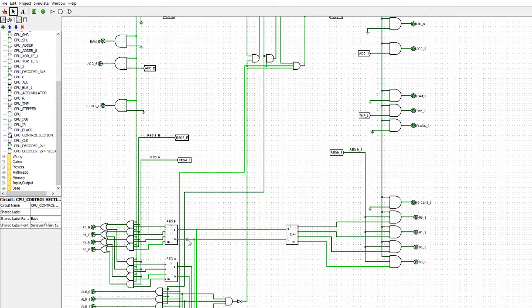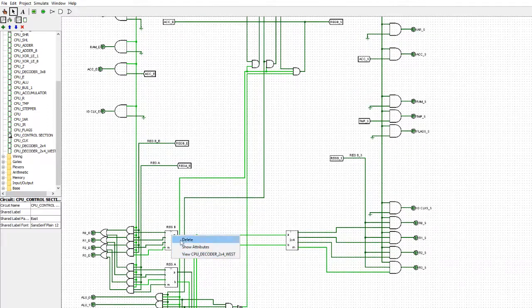Now if we go to the left, that's going to a decoder. So it's just a 2 to 4 decoder. So it takes the value 00, 01, 10, 11, and it chooses the registers R0, 1, 2 and 3. Okay, so you can see at the moment that because that's at 1, 1, that's value 3. If you're starting at 0, it goes 0, 1, 2 and 3, so it chooses this here. It's trying to choose this top right here, it's trying to choose register 3.